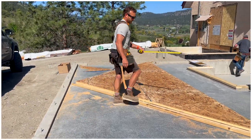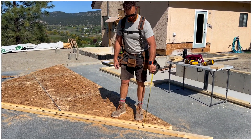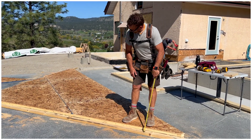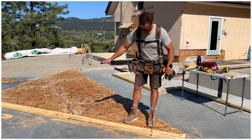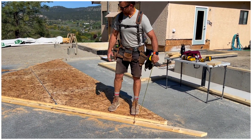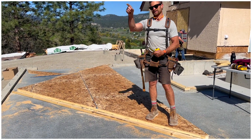What I like to do is get my gable end laid out and put it on top of the truss that will go directly behind it, so I can do all my layout for my ladder in place and make sure all my layout is perfect. I get my rafter tail dialed in, I get my fascia lengths — everything is prepped and ready to go. Then we'll start spacing it all out and putting it together.